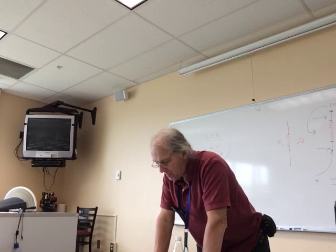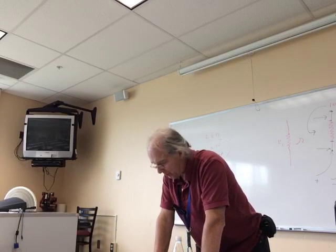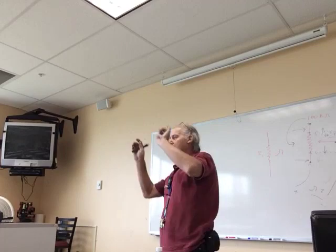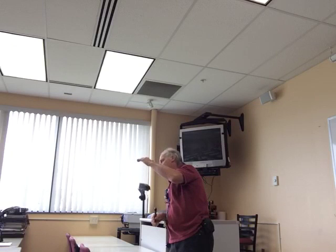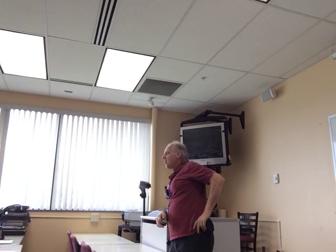Now, if you look at figure 8-14, they have a pot, don't they? Notice the pot's in the center. It's not all the way up, not all the way down. It actually produces a voltage divider by using a pot. Kind of fools you. It's not two resistors, but when it's in the middle, say 100K, that's 50K on each side. So that makes a two-resistor voltage divider. That would be a variable output voltage divider, again so that we can bias something that doesn't draw a lot of current.